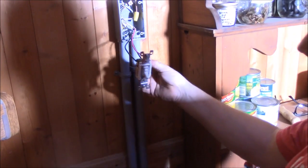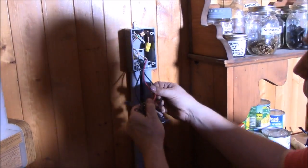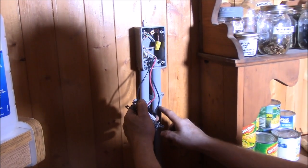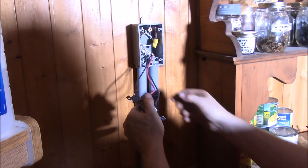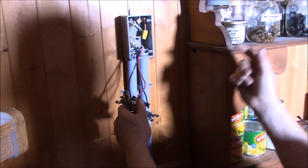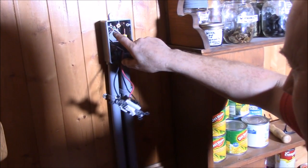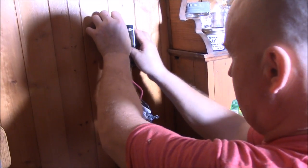So now running on down to the other light switch, because there's a light switch in the basement, it's a three-way. I have the black and the red from the three wires down there running to the two brass ones. And then the red one from my supply line runs to the black one, same as down there. And then my whites are tied together. And then I have a pigtail from the ground off here, wire-nutted together with all the rest. So I think that'll be good.